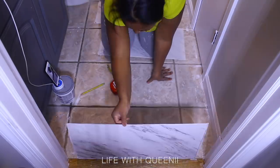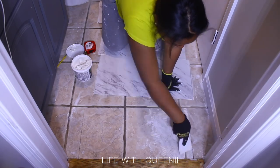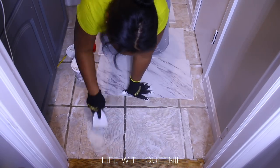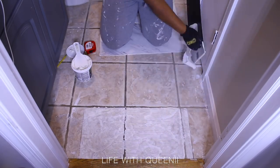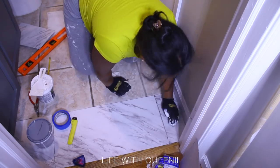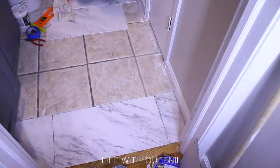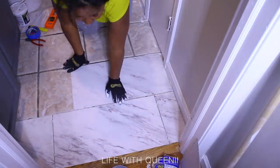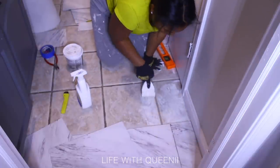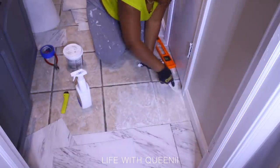I also bought this product called Stick and Stay adhesive and I'm using a spatula to spread it out — just a nice thin layer. You don't want too much because it will squeeze out between the grout lines if you plan on grouting, which I did. The tile has a six-year warranty, and yes you can put peel-and-stick tile over existing ceramic tile — that's the point of this tile. For renters I'd suggest floating floors instead, which you don't glue down and can take with you when you move.